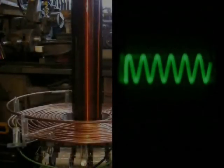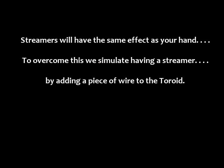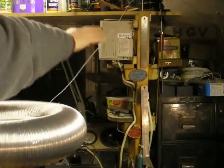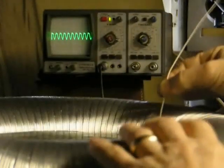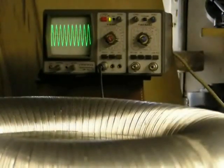If you move your hand close by, you can see how it alters the self-capacitance of the coil and therefore its resonance. The reason for showing you this is so you appreciate that the streamers will also have the same effect. So it's a good idea to simulate this when tuning by hanging a piece of wire from the toroid — this should be the same length as an expected streamer. Look at the oscilloscope and you will see the result of approaching the coil and then leaving a simulated streamer attached to the toroid. Remove it and the coil is back in resonance.